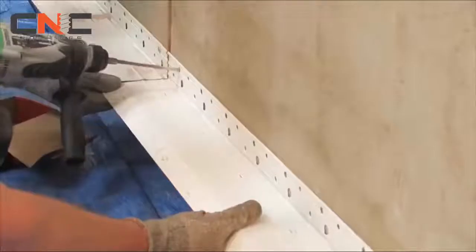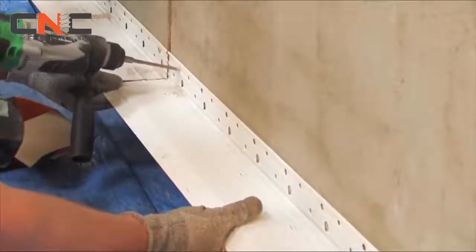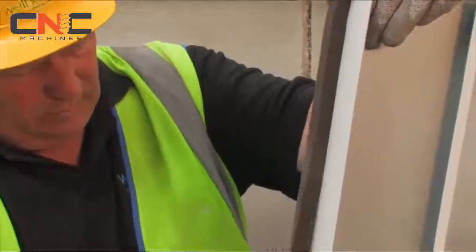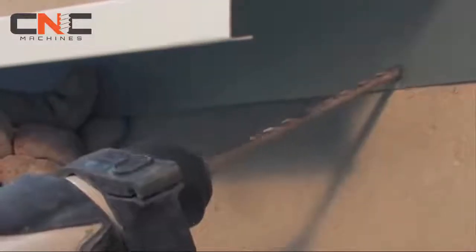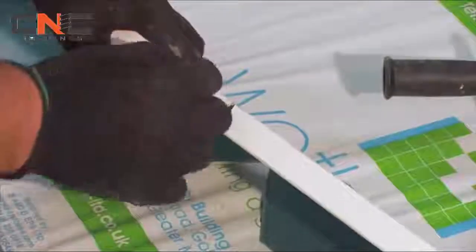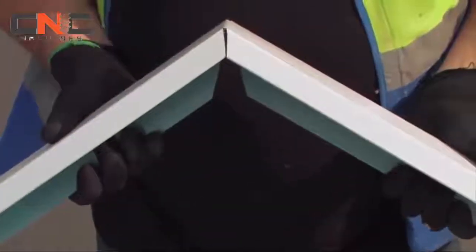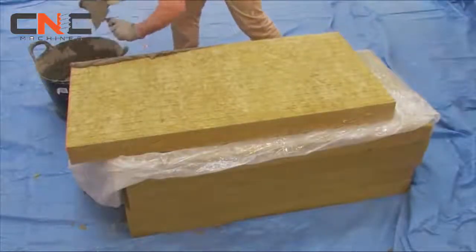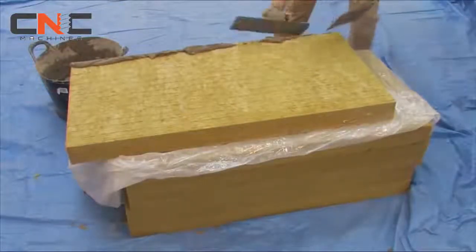The base rail profile type is determined by the insulation thickness and should be installed at a maximum of 300 mm centres and 50 mm from each end, using approved Weatherby fixings. Where verge trims are required, these must be installed in accordance with the Weatherby specification, including a sealing tape and silicone sealant to ensure the system is protected. The verge trim must be cut and bent into place at the gable apex to prevent an exposed joint at this point. On low-rise applications, bedding adhesive is only required to level insulation boards on uneven substrates.